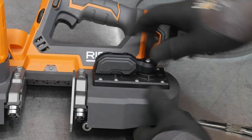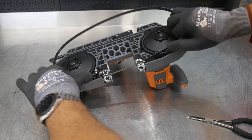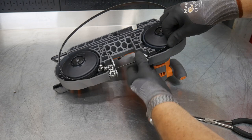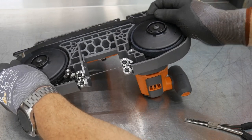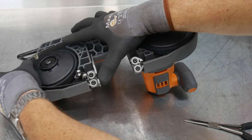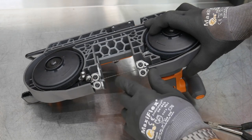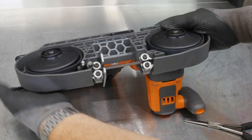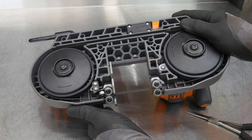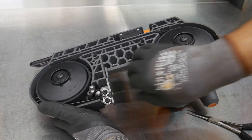You have arrows on the wheels telling you which direction this is turning. For blade changes, very quickly without any tools you just flip this up, flip it all the way around, and your wheels are out of the way. Release the blade guides first — it helps to have cut-proof gloves on. Keep some tension on it, work it around, make sure you're all the way down into the channels where the blade rides, then take your lever and it self-tensions everything.